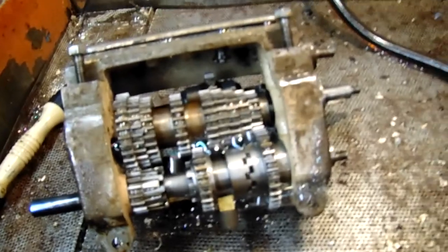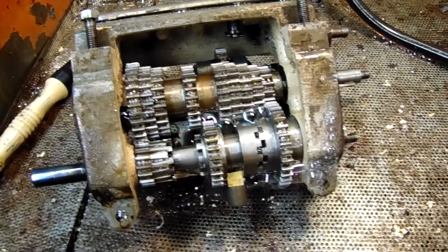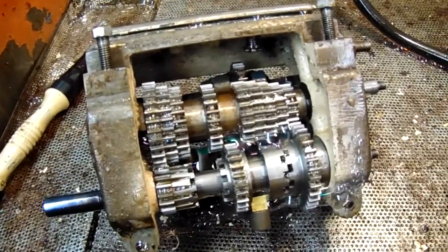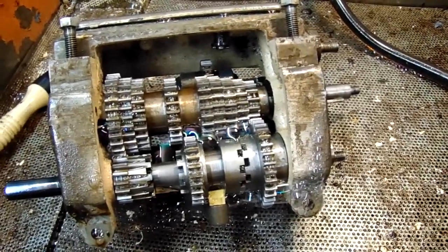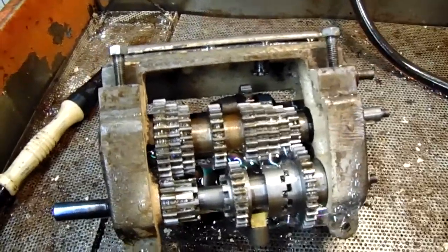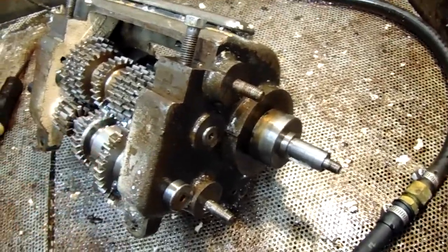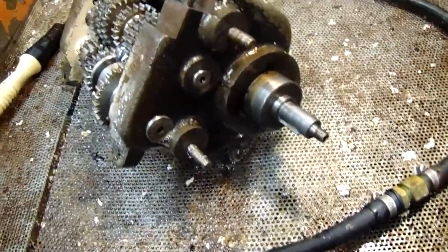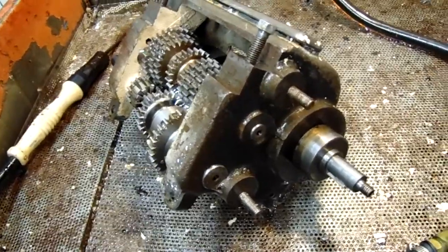The reason I soak stuff like this — I could take it apart, soak each piece, clean it individually and probably work faster that way, but I work on other stuff while I'm letting this sit. Second, why work all that grease, chips, and paint when you can just let it sit for a week and come back to pretty much clean materials? If I have to heat something now, I'm not worried about grease catching on fire. It's going to be a lot cleaner to work with. Stuff comes loose easier after it's soaked too.